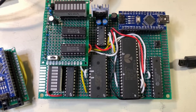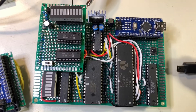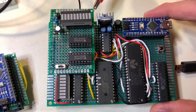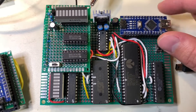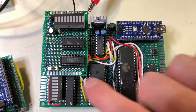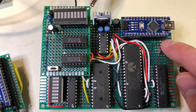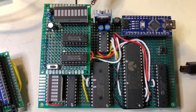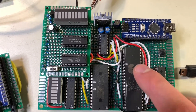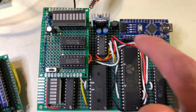I basically just didn't want to lose serial data — I didn't want it to miss commands going in or data coming out of the machine. So to keep everything simple, I decided to have the Arduino drive the clock signal for this chip. It also does the reset signal for when it's first starting out, but everything else after that it's very hands-off. The only thing it does at that point is the clock signal and the serial.